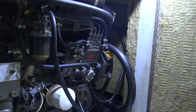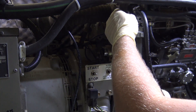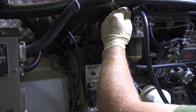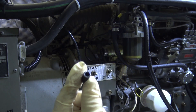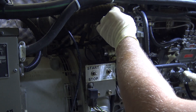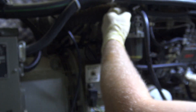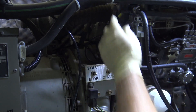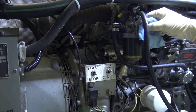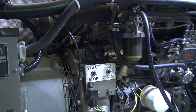What we'll do real quick right here on the filter — on these Yanmars or these Martins — there's this little clip here and then a little tiny cover. We can pump it and see we've got plenty of fuel in there, so let's close that right back up. If we do start to suck air or have air problems, we'll take that off and bleed out the line up to that point, and if we're still having problems we'll bleed out the top — but we should be good.